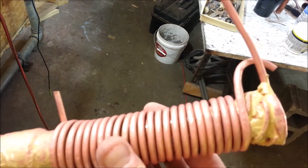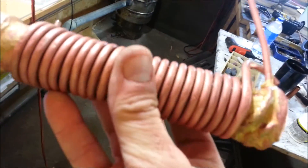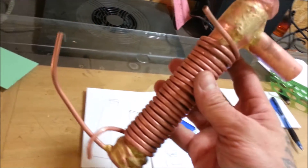Now what I'm going to do is braze this super heater coil in place. I didn't wrap it all the way around the exhaust chamber because I simply didn't have a long enough coil. This coil came out of one of the old hydrothermic engine experiments — one of the first ones I ever did. So I was able to get some use out of that.